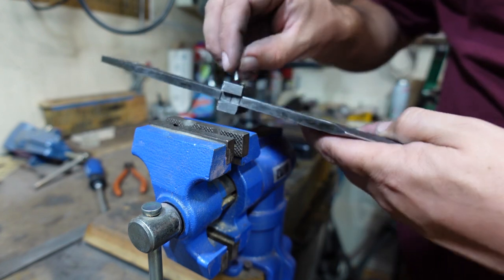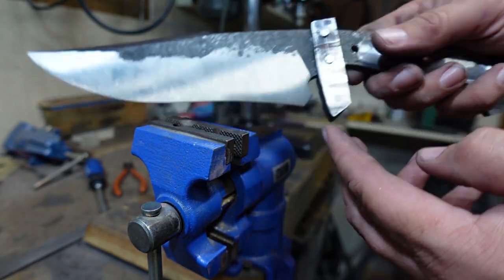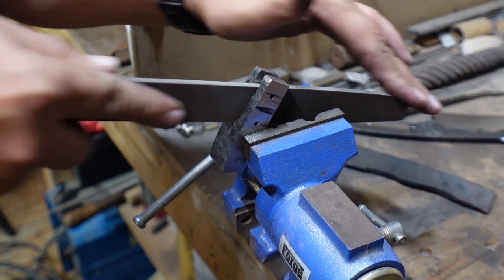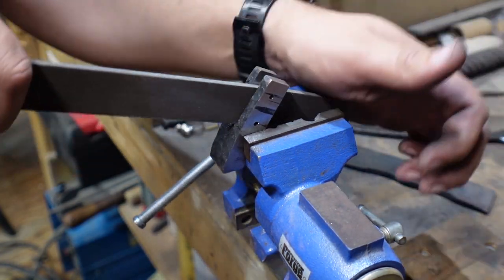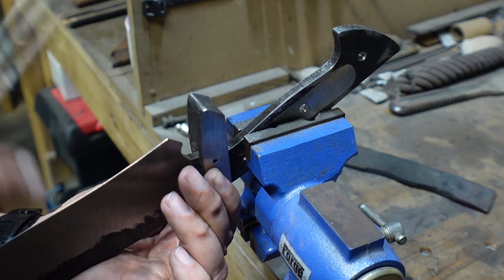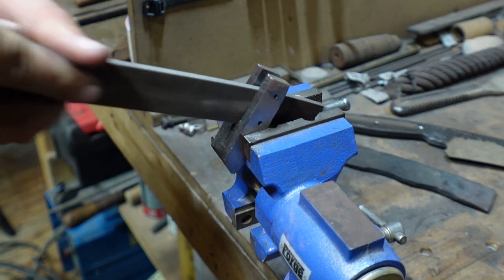This first fit-up was just trying to make sure that my pinholes matched up so I could see exactly how much I needed to fill in that little area where I had the gap. The nice thing was there were no gaps on either side, so all I needed to do was add a little bit of material to the bottom and then file it away. Then it was a bunch of filing, putting the guard on, filing some more — and once I did that last little bit of filing it lined up perfect.